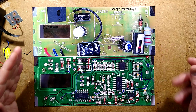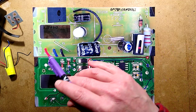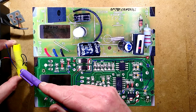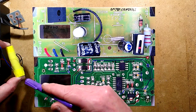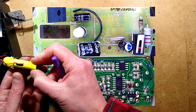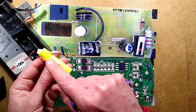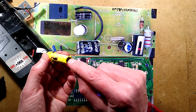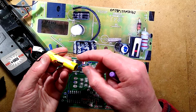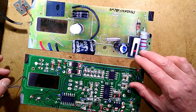There are some strange quirks but they seem to be mainly to protect the circuitry from the quite high voltage spiky transformer based on this ferrite core. The ferrite core has two windings: a low resistance winding in the region of about 1 ohm, and then a much higher impedance winding of about 1.7K which is the high voltage output winding. There's a super fine winding coming off this and going into this well-insulated red wire — that's the high voltage wire going out. They've used a ferrite core as a transformer because it's one of the easiest ways to make a customizable transformer in this application, with layers of tape between sets of windings. Very functional — it's doing exactly what they want.